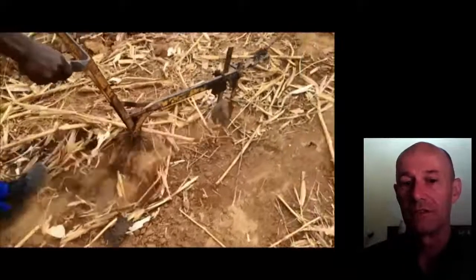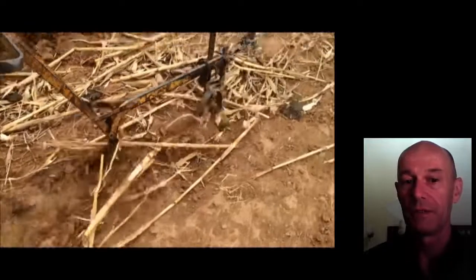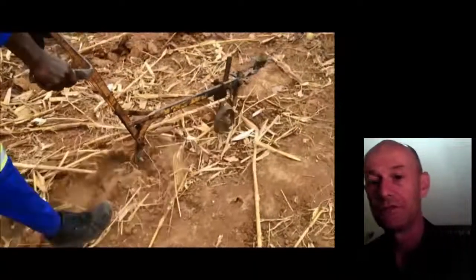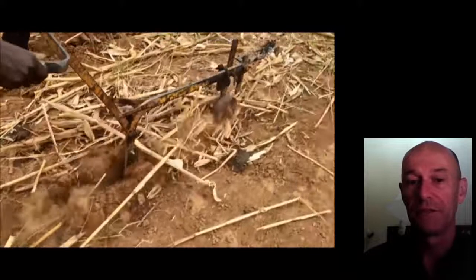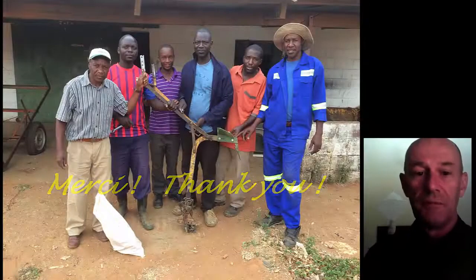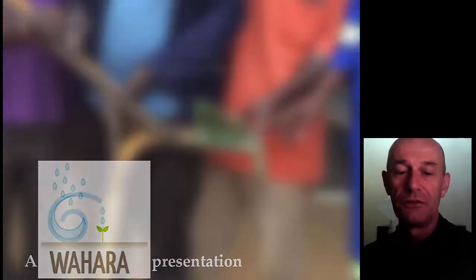Another detail is that there is often a lot of stover lying around on the land, and it should not block the tool when working in the field — and actually it doesn't with this tool. The stalks of maize just slide by and don't block it. Normally farmers allow cattle to graze and the stalks reduce in number before ripping for the next season. This is the team in Magoya who were involved in the testing of the Magoya Ripper and the Kapandula, and they thank you for watching. They hope the Kapandula will be an excellent tool for Burkina Faso farmers as well.